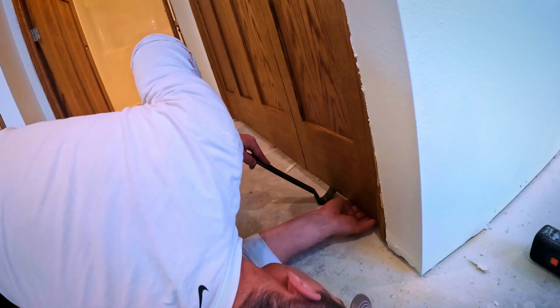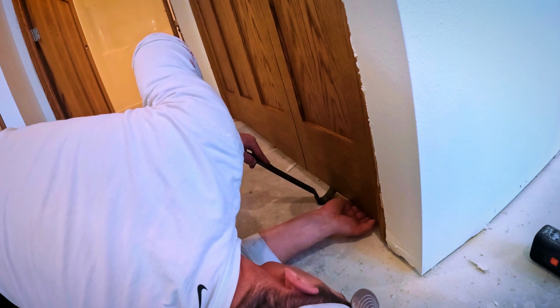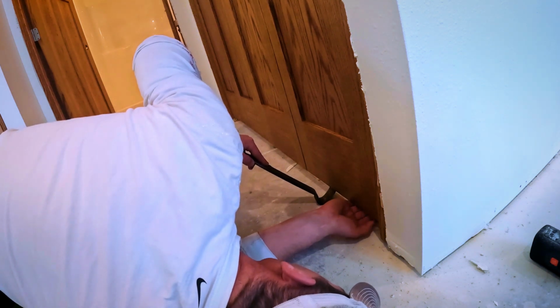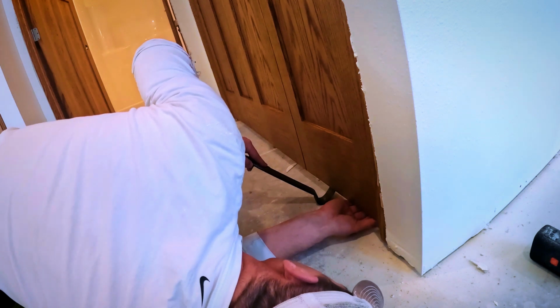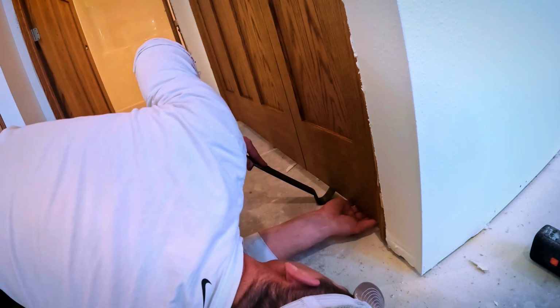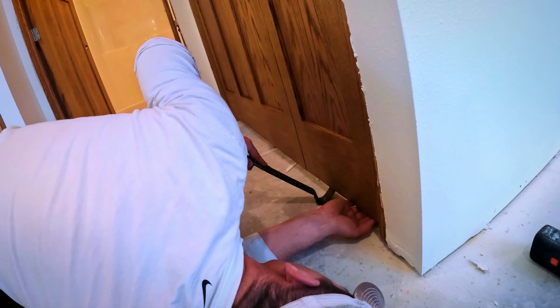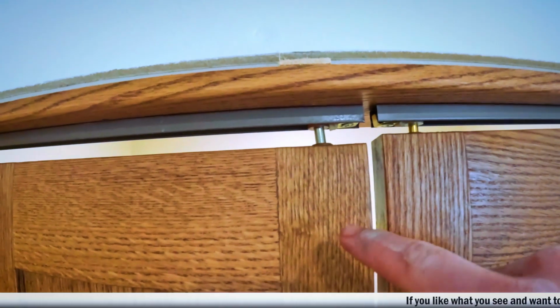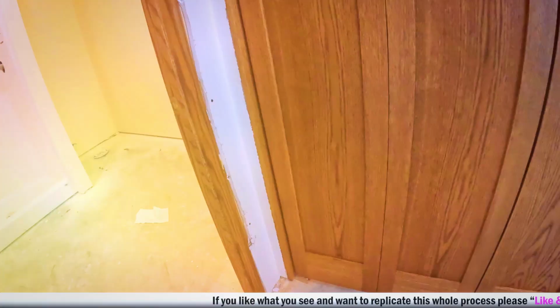We're going to just turn that knob that we oiled up earlier with the WD-40. We're going to go up about 1/4 of an inch. And since I did it on this one, we'll probably have to do the other one. All right, so now that is in there much nicer, but now I'm off a 1/4 inch or so. This one is low, so I need to bring this one up. So, doing the same thing, but on the other door.